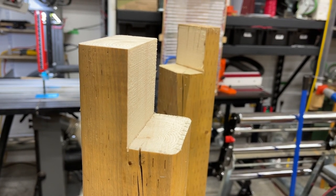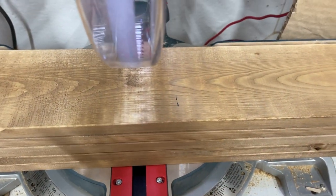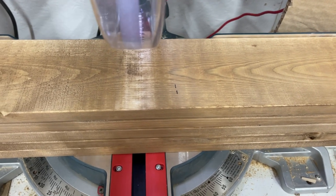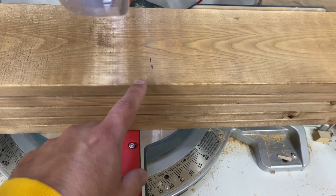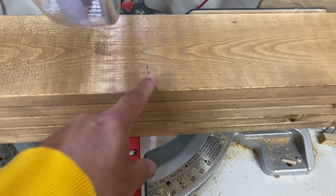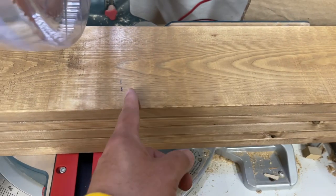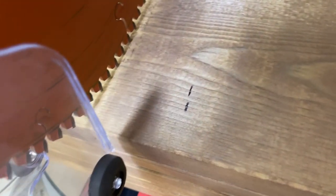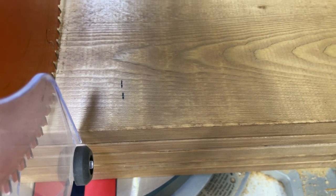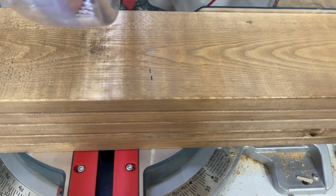I have all the fence boards and I realized this is why every carpenter, every woodworker needs a 12-inch miter saw - because I can do it all in one shot, just line them up and make one mark instead of having to do a whole bunch of repetitive cuts. To get to the center of the board I measure in from this way and make a mark, then measure in from this way and make a mark, and then I cut right through the middle. We have our lovely shadow line there, so line the shadow line up, make a cut, and you're good to go.